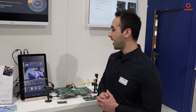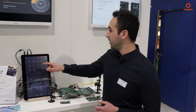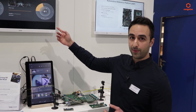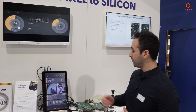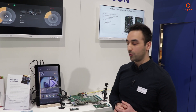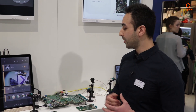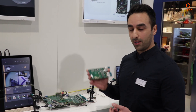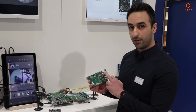The UI uses Qt and QML technologies to enable rich and fluid animations, and the platform is capable of driving multiple displays — the screen up here is also being driven by the same board. We also have the ability to add additional displays: one more DisplayPort and LVDS. And as mentioned, we have these highly flexible HSMC connectors which can be used to bring in additional connectivity, like this port from Innova for adding multiple APIX display inputs and outputs.